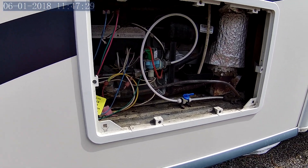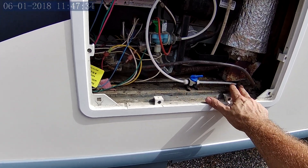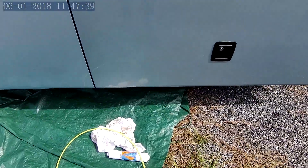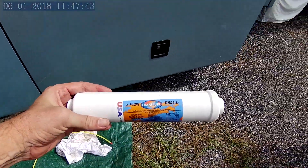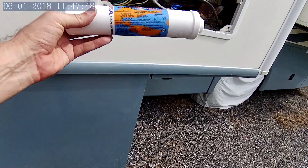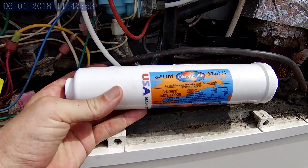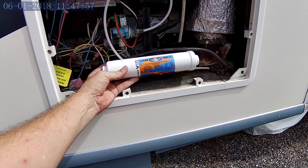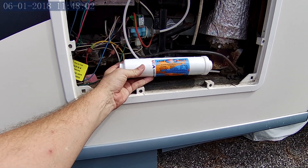What I'm going to do is move this valve back, disconnect the line at some point, and I have an OmniPure filter — a little OmniPure filter I ordered off Amazon. The idea is to get it inline here. Make sure you know which direction your flow is going. I have a little bracket coming that's going to mount down and hold this in place, and this will be my new replaceable little water filter.